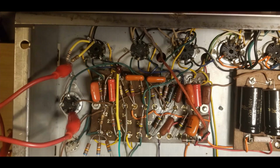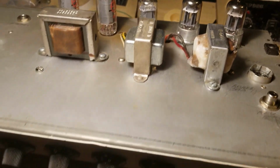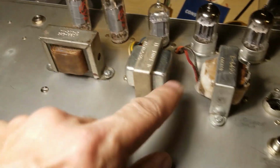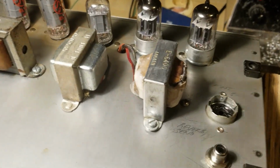But I want all of that. So the only other thing to do would be to suck out all the mids, which is driving the amp. And the tone controls didn't really work as well as I thought they would, because again, there was so much mids driving the amp. It was just getting in the way of the tone controls. And the buzzing that I'm hearing sounds like grid distortion. And as you look at a picture of the output transformers, you can see that they're all very small. And so it wouldn't take much, I would think, to saturate these transformers. So suck out all the mids.